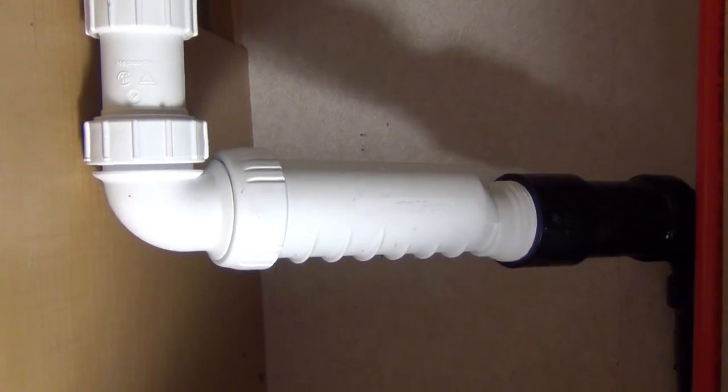After making my cuts, deburring the ends of the pipe, and being careful to mount the new valve with the ribs on the bottom side, the installation is complete. No more sewer odors coming up from the holding tanks. Though I feel these installations are relatively simple for any RV handy person, if you don't feel comfortable installing the HEPVO valves, simply call your local RV service facility — they'll be more than happy to install them for you for a nominal fee. Thanks to the HEPVO valves, you can now enjoy odorless RVing with confidence, plus gain a little more room under each sink. If you're a serious RVer, you owe it to yourself to check out the HEPVO sanitary valves. Thanks for watching.